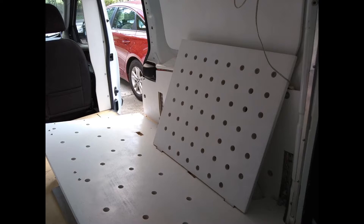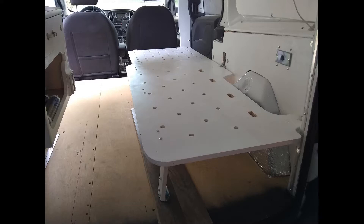Here's the completed platform. You can see the wall has been skinned and there are cutouts for access to the L-Track to be able to adjust this up and down. It is a bit fiddly — you will have a bit of a learning curve to learn how to adjust this. You have to rigidly hold the mounting piece against the track as you adjust it up and down because it easily wants to come out of the track, but with a little practice you'll find that you can adjust between the high and low position in a couple of minutes. You do need to adjust one bracket a couple of notches and then adjust the other one, going back and forth between the two brackets, but I've gotten to where I can adjust it in a couple of minutes from one position to the other.